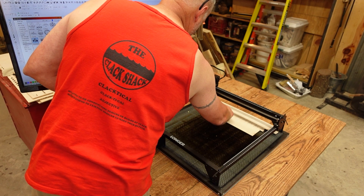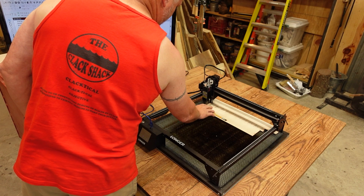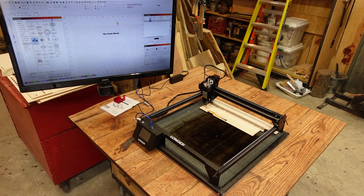When I realized it did not have limit switches, in order to put this in the same spot every time, you have to make sure you position the pen in the same spot every time. That's why I use my jigs. I've got the text centered in the little tool line right here — that's my reference for where everything is. This is basically the map of where the pen sits, and that allows me to put the text where I want it.